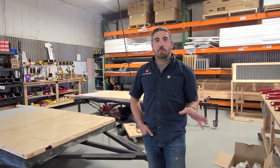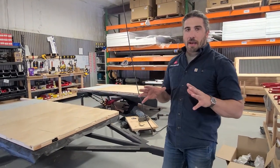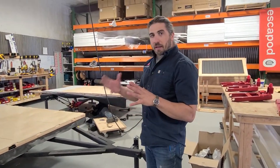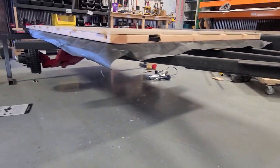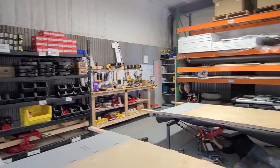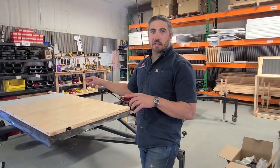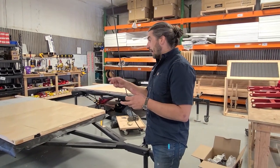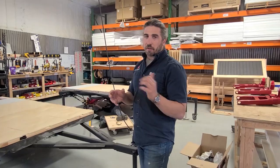We are standing in bay one — they're about two days in right now. We bring the raw frame in here after it's been powder coated and had that polyurea coating we talked about. Once it comes in, we lay down the underlying material, then lay on the floor and build the walls up from there as well as the cabinet structure. Before this trailer leaves this bay, it will have wall-mounted cabinet structure, the headboard, and wiring in place — though not yet finished. We finish that in bay two.